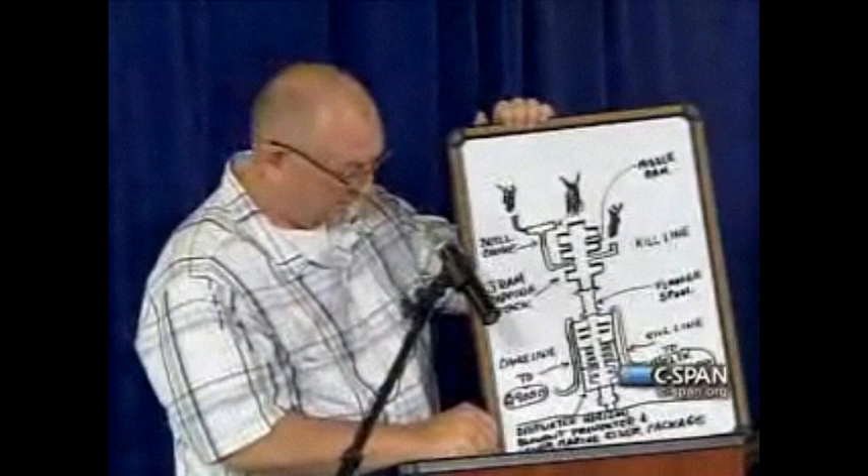If the pressure continues to rise, we will monitor it every six hours — looking at acoustic information, seismic information, visual inspection of the seafloor. If there are no problems, the decision will be made in six-hour increments to proceed. At the end of 48 hours, we will stop the test and assess all the information we have. We will probably do another seismic run over the area around the well to detect any potential hydrocarbon or methane leaks from the seafloor, and then assess whether or not we need to go into another cycle of closing the capping stack down and taking pressure readings.